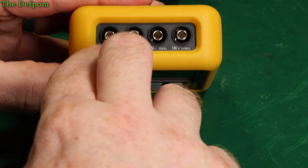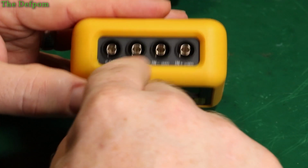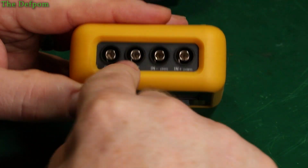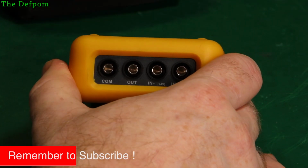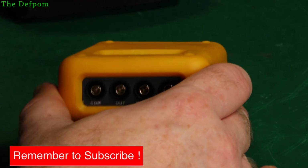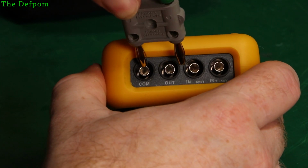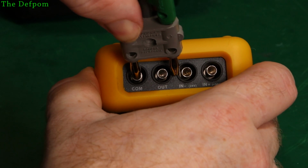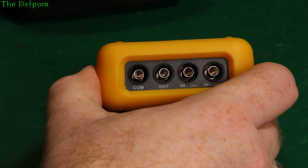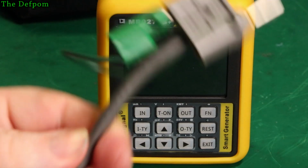You can do that. Now, interesting about these plugs, obviously because of the form factor and the size of this, these are not the standard spacing. So you can't get one of these dual plugs and just plug it straight in. It doesn't work like that. Unfortunately, I did try. So here's a standard plug pin out, the standard spacing, and you can see if you try and plug it in there, it's out a little bit. But it's also a compromise I had to make in order to fit into this form factor, so I can understand why. This means you can't use those pre-made dual plugs.